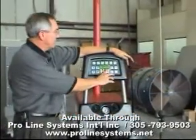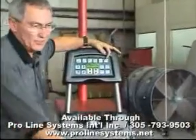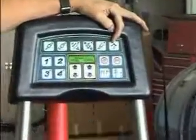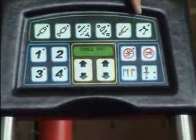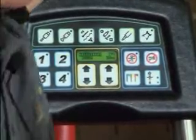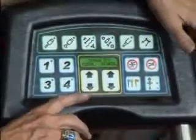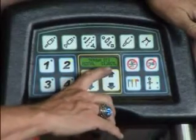The machine comes with 5 different welding modes. The first and the most important, of course, is the two-sided pinch welding liquid-cooled clamp. We also have a single-side welding mode if we're only able to weld from one side and can't reach behind with the electrode tips. When the machine is in the setup mode, we need to tell the machine what arm set we've installed on it.